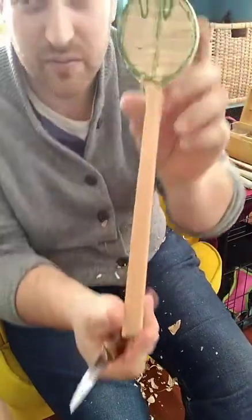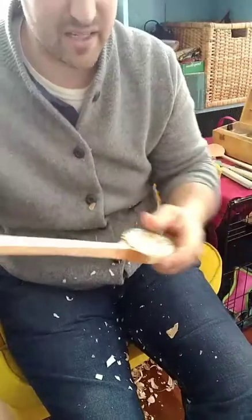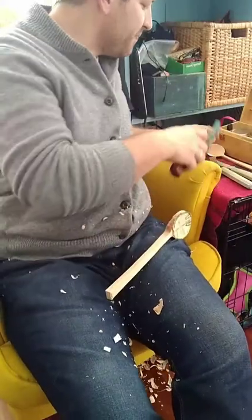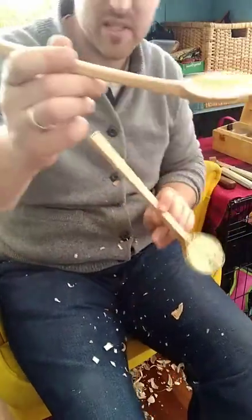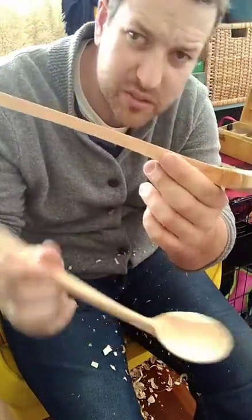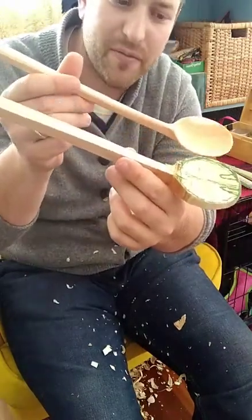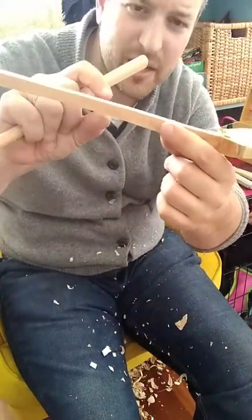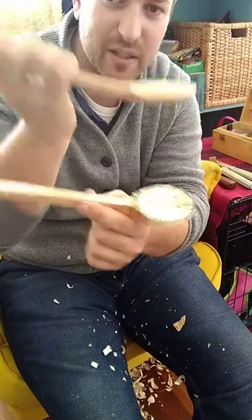I've roughly done these neck transitions — just cleaning them up enough to approach them later. Now I can see that this one has a very subtle curve this way, while this one has a subtle curve the opposite way — there's an arch there. That's probably the first thing I want to address, because how much I can push down this arch without making it too thin will define what I need to do to get the angle roughly matching the other one.